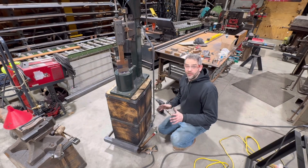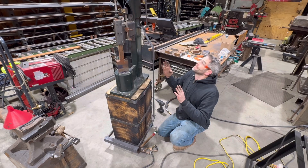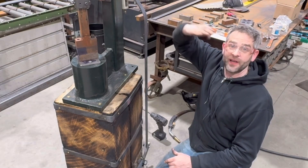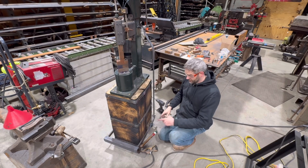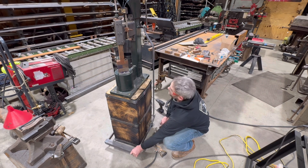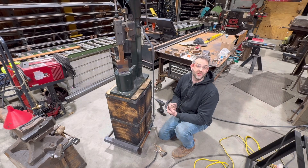It's the moment of truth. In any lever system it's all about the ratio of one pivot point to the other, and this is honestly the first time I've done a treadle like this with these pivots. What I'm looking for is that the control valve gets to 45 degrees, which is enough travel. I pivot this — oh yeah, there we go, I think we've got it. The real test will be when I hook the air up to it, which we might have to do right now for the fun of it.